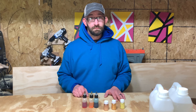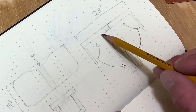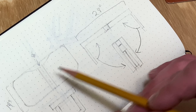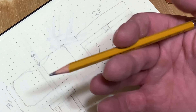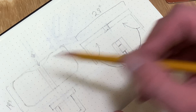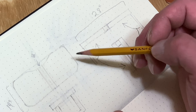For this we want to be about 28 inches. We're going to have it fold in the middle so that way you can pack it under the bed or wherever you want. The legs will also fold up, and we want to put this indent in there so that way when it's sitting on your lap it can get a little closer to you. So we need to cut this board down to about 14 inches, cut it in half, and round off these corners.